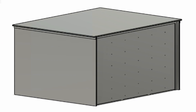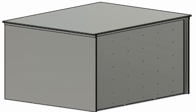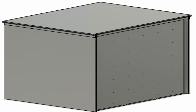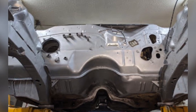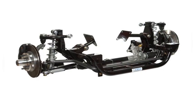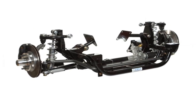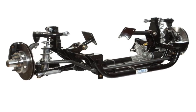Here's the completed box for under the hood. This holds 12 of the modules. I'll have another four in the trunk in a single wide box — same idea, all watertight, so it'll keep the battery modules in good shape for a long time. This will fit right where the engine was, skewed slightly to the right to give room for the steering, mounted on top of the K-member exactly the way the engine was. I've special ordered a K-member from Gerst Suspension — it won't have any motor mounts so I can build my own battery box mounts.